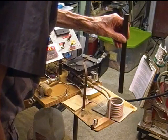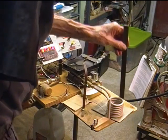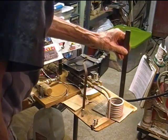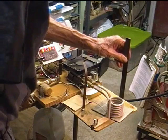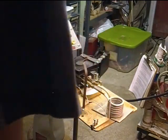Now putting it just outside the coil, maybe one ampere — that's about it. If I go any further, the amp meter doesn't budge at all at around three inches. So again, about one ampere when this bar is right up against the outer edge of the coil.